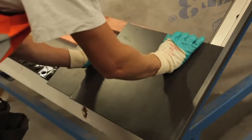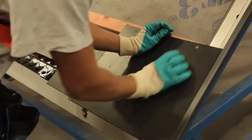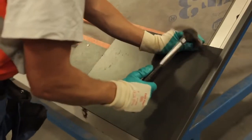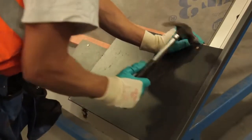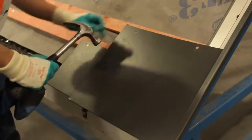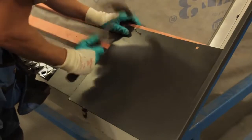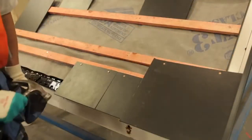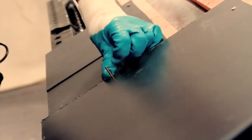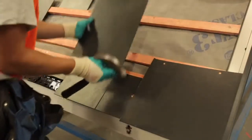Fix the fiber cement slates to the battens using the nail and rivet method in accordance with BS 5534 and BS 8000-6. Slates should be laid broken bond using slate-and-a-half-width slates in alternate courses, formed from double-width slates at verges, hips, valleys, and abutments. Allow a five millimeter gap between adjacent slates for the disc rivet shank.